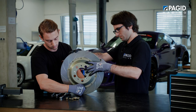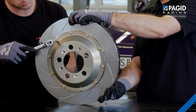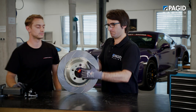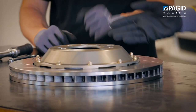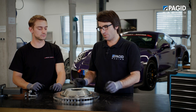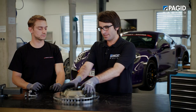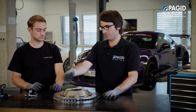It is important to do it crosswise. After tightening all screws with 14 Nm, we are ready with the assembly process. The axial and radial float is available. In cases it is not perceivable, you can use a rubber hammer, give a couple of touches and you will notice it becomes perceivable.